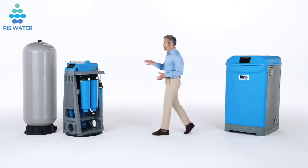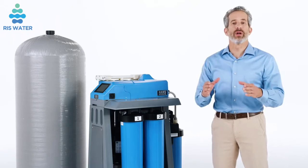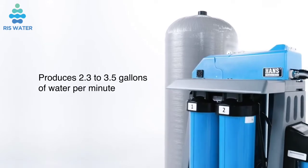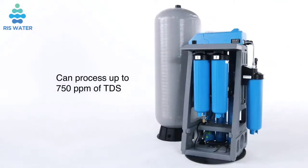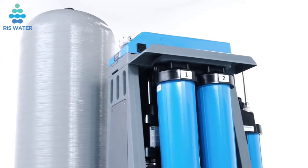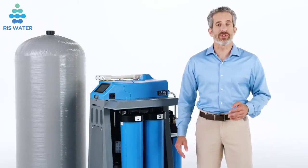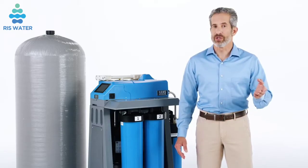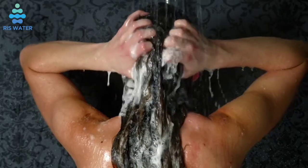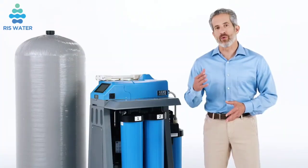For lower capacity residential and business use, there's Hans Premium Appliance Model 1. It's the original all-in-one, whole house water cleaning appliance. It produces 2.3 to 3.5 gallons of water per minute, and can process up to 750 ppm of TDS. It's an ideal whole house water treatment system for residences with one to four people. Like Model 2, Model 1 uses a four-stage system. It removes hardness without salt, monitors water quality and usage, and provides clean, contaminant-free water from every faucet and shower in a home. But unlike Model 2, it uses a single-speed pump and it requires a pressure tank.